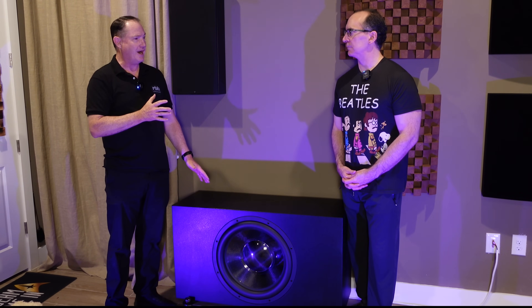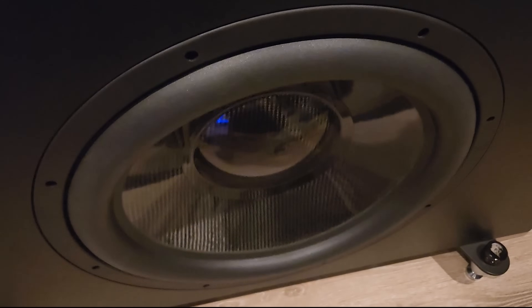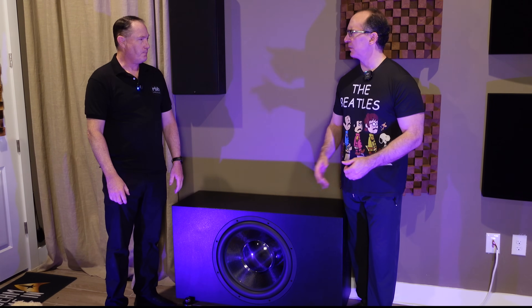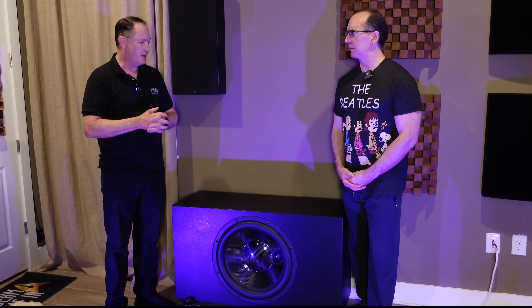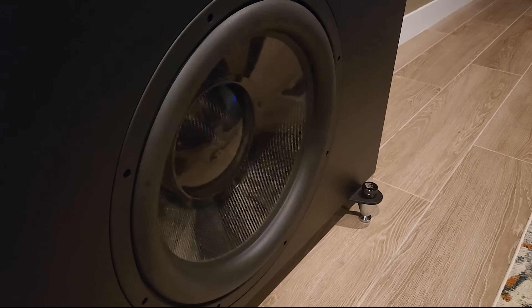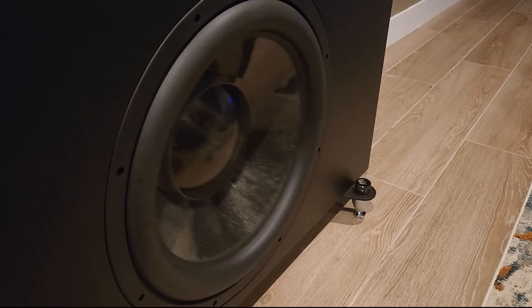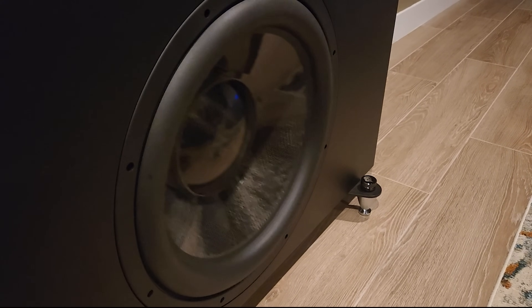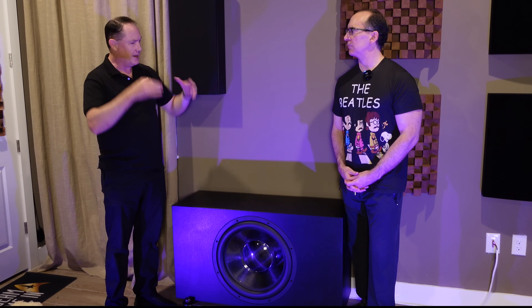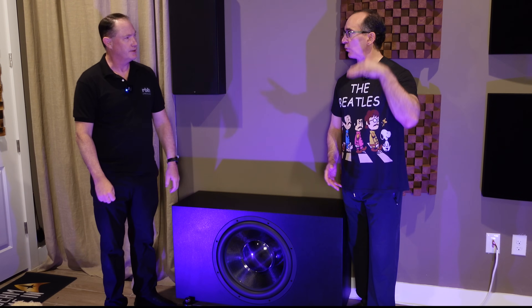This is being boosted below 25 Hz, but it has a much lower resonance frequency and incredible excursion. The Xmax is 38 millimeters. You can see it has a very large roll surround. Some commercial 21-inch drivers have that accordion-style surround — they don't have the throw of a driver like this. The characteristics of that pleated surround don't lend well to sealed enclosures; at high excursion it folds in on itself, causing non-linearities and high distortion at low frequencies.